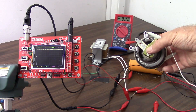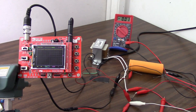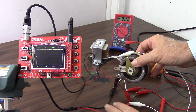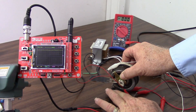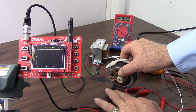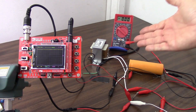I have a 100 ohm rheostat here, and I'm going to hook that in — just put that in parallel with the capacitor and see what that does for us. I have the white clip lead there, and I'm just going to touch the other side. Watch what the oscilloscope does — 100 ohm load. If you look carefully, you can see the voltage is coming down a little bit, but it's still remaining pretty flat. So our load is bringing our voltage down — that's to be expected. We have an output impedance of our power supply, and when we take our current through that output impedance, we expect to lose some voltage.